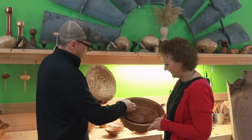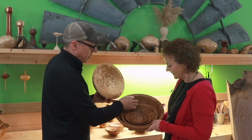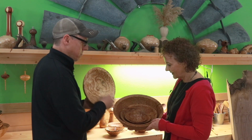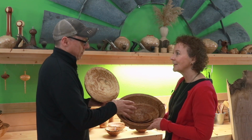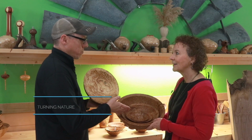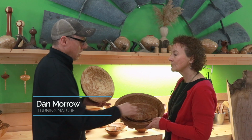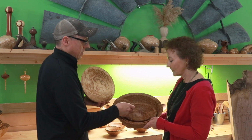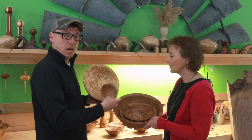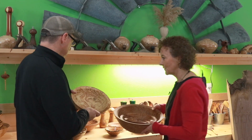Right. This one's called an eyed burl. It has all these little pin eyes, kind of like a bird's eye, but it's black ash. And with expensive wood like this, you try to get as much out of the product as possible. So I have coring knives. As that bowl is spinning, I'll take this smallest bowl out first, and then the second, third, fourth, fifth, however many I can get out of that piece of wood. That one is just very unique.